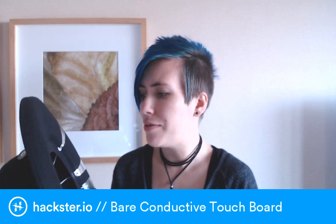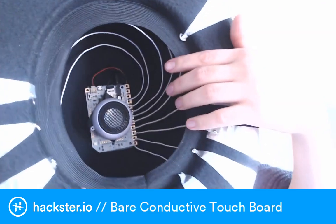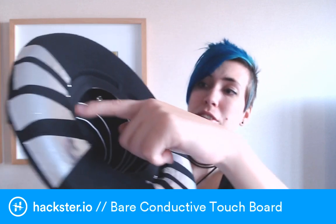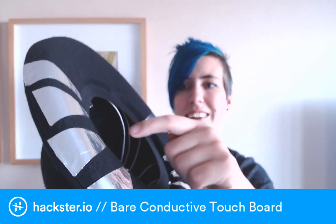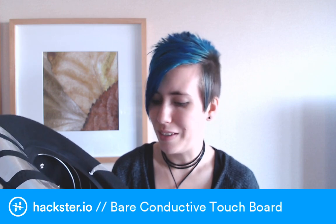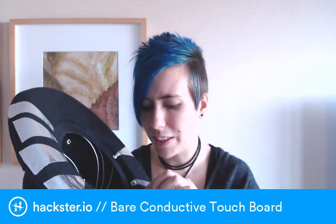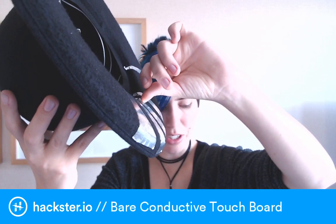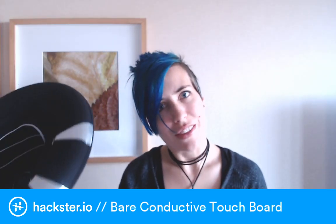These are both super cool platforms. You can also use Chirp on the Microsoft Azure IoT board, which has a little OLED screen. The touch board is not brand new, but I've never been able to use it before because I hadn't had one — they generously donated some to the hackathon. Here's the wiring again: I've wired stuff up to the contacts and threaded those wires around, then soldered them onto aluminum conductive tape. Unfortunately aluminum tape doesn't solder very well — some of these are coming off, which is why a few weren't working. It's also a giant heat sink. Lesson learned for your next wearable project.